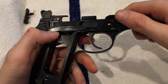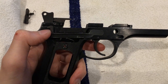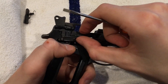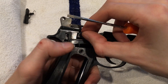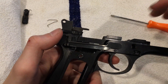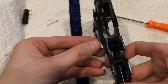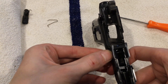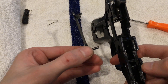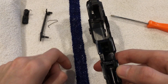Let's remove our firing control rod. To do that, we're going to want to remove this spring here — just kind of push it out. It literally comes right out. This bar here is just going to start to pull out. There's another spring on this — you might hear that click. That's for your trigger, we'll worry about that later. Now that is off — simple as that.